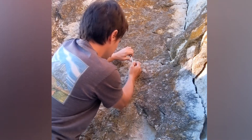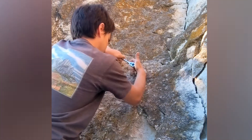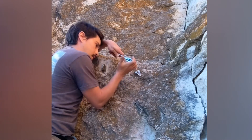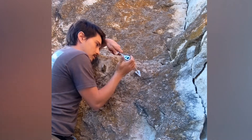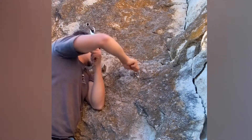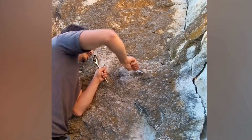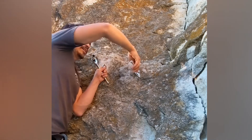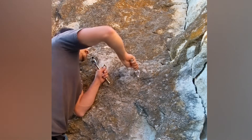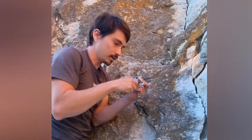Still pretty tight — there, it loosened. I would think that's still pretty tight, tight enough to trust. You can see it comes out pretty easy once you've broken the torque. I definitely think for soft rock — really for any type of rock with these concrete screws — just go with the long ones, the six-inch long ones. They're really pretty solid. You can see that's most of the way out and I can definitely wiggle it back and forth — it's just got a little bit of bite in there. I'm just going to keep wiggling it out by hand. I don't think this is something that's really going to pull out on its own catastrophically. Even with just the last couple of inches in, it's giving pretty good bite. On the last thread I was able to wiggle it out.